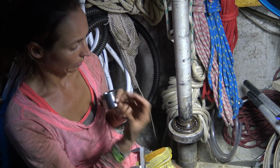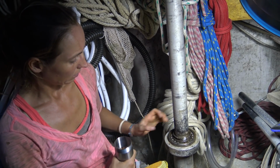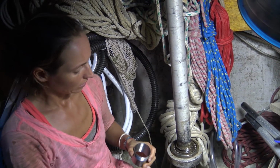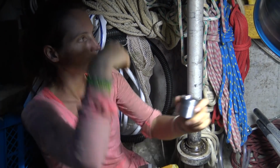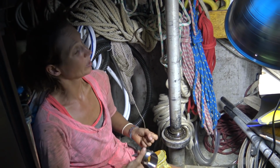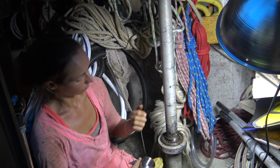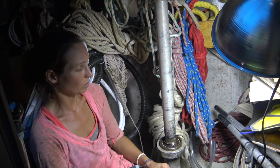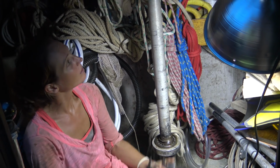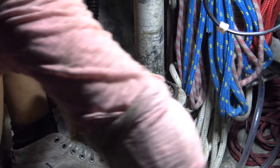Potentially. So the bottom part that's holding it up is loose, and we're just gonna now smack the shit out of it from the top, pushing it down, and also put something between the rudder and the hull to pull the rudder down, because any direction doesn't matter. Pulling it up is really hard for us here, but maybe just smacking it down could hit the bottom part loose. Basically, we just want to break open the corrosion. It doesn't matter which way it goes. And we have a little bit of room up there to smack it down. I just want to take our yard frustration out more. Yep. Alrighty. Come on, Bill.